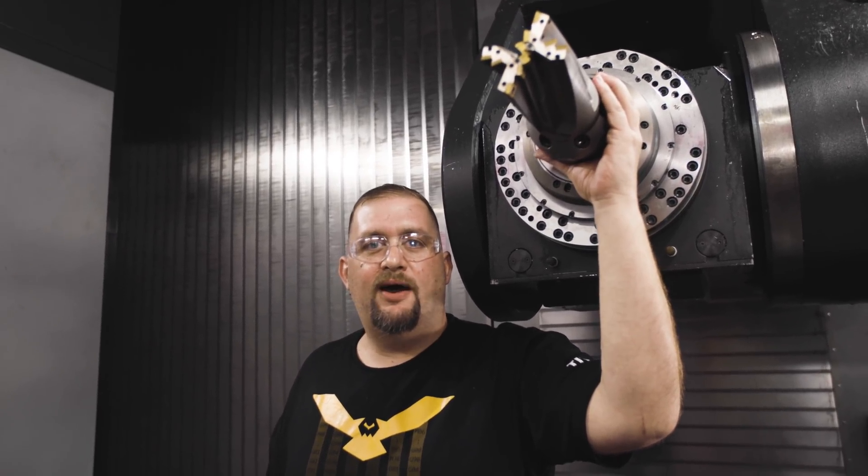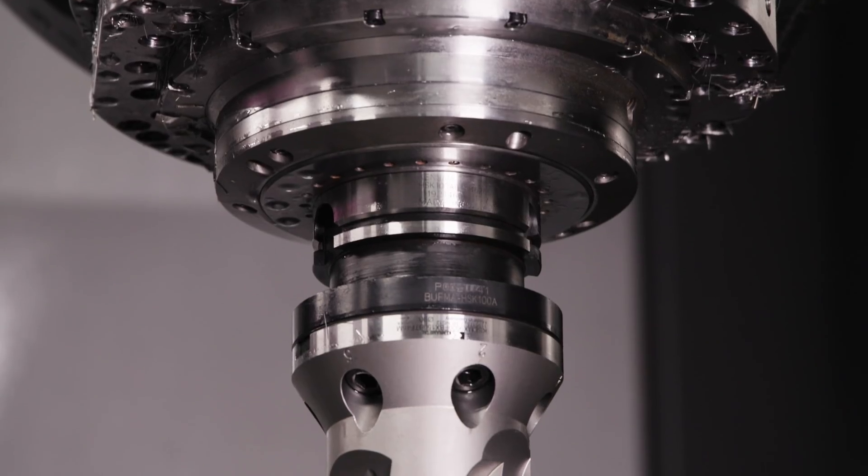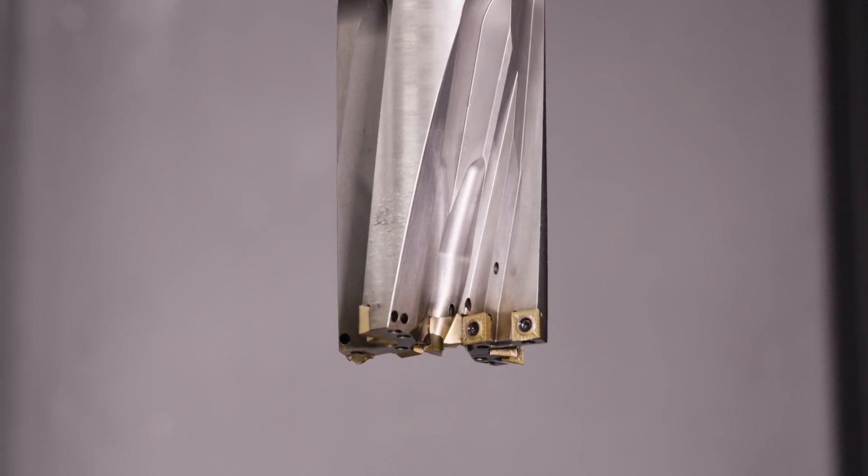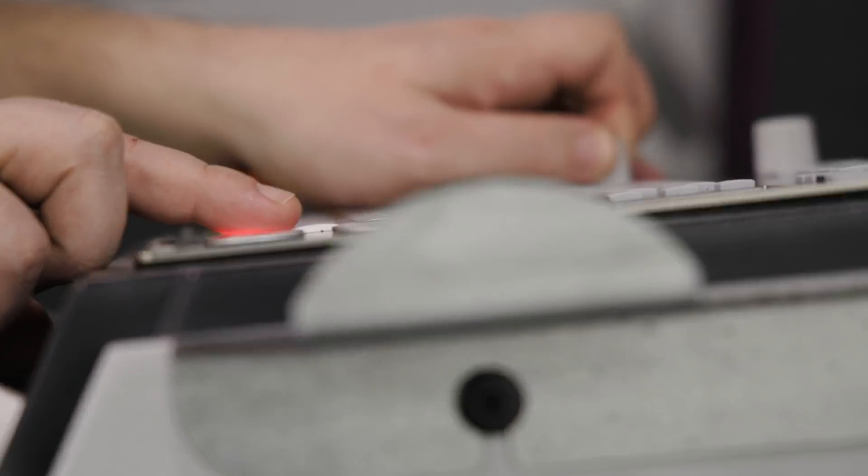So I re-ran the calculations and that puts us at 130 horsepower and 450 foot-pounds of torque. Now that's almost 30% more than what this spindle's stated capabilities are. So at four inches per minute I was already terrified, because this is a huge drill and big inserted drills have always scared me.